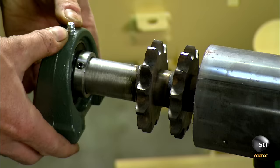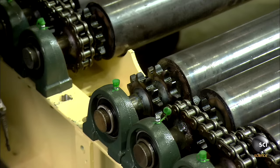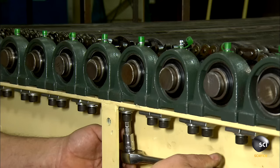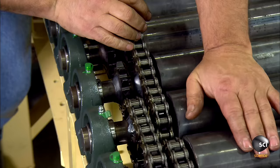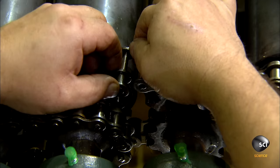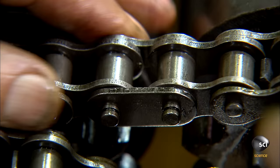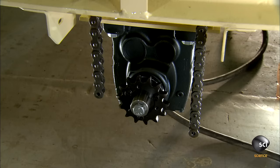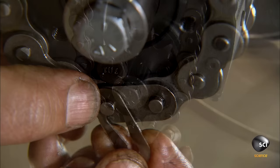Next, workers arrange the rollers on the conveyor frame. They place the bearings on the flange of one of the vertical rails and attach the bearings to the rail with socket screws. One of the workers attaches the welded steel chain to the teeth of the sprocket wheels and joins the sections of the roller chain with links. Then he drops the ends of the chains down to the motor, loops the chains around the motor sprockets, and connects the ends with the joiner plate and retaining clip.